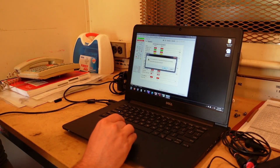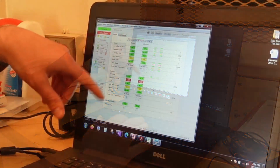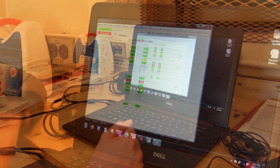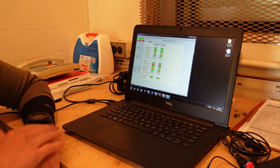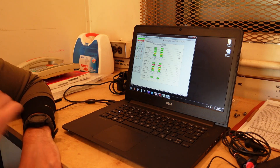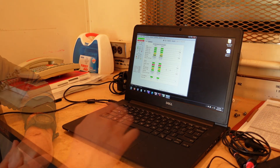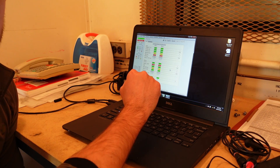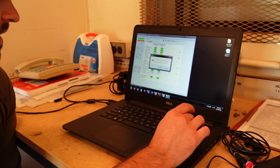We're going to turn on our transmitters and see if that corrected the reverse sensed issue. It looks like when we cut 45 inches out, that gave us 164 now in the 150. So we're going to put the quad cable back in and just re-verify everything is good on the phasing — just make some fine tuning adjustments after that rough cut. Verified phasing: still at 1 in the 150, almost 0. So we can take the quad cable out and set up our final widths for 155.